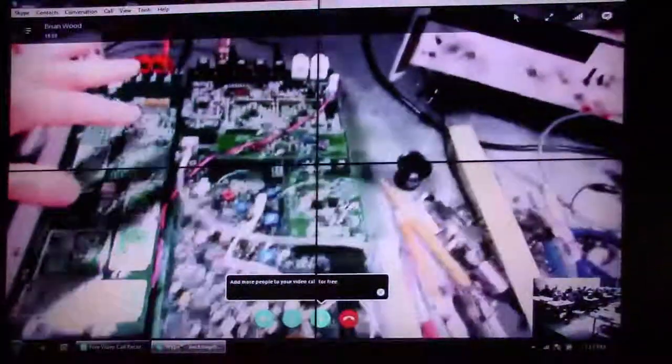It's a very complicated board — there's no way I would ever make anybody try to load that surface mount themselves. We've occasionally had people ask, and there's just no way. So all this stuff in here is the low power section of the rig. The other half is the high power section. That's the 10-watt power amplifier. What comes into there from the other half of the radio is low power, just about 100 milliwatts or so, and it gets amplified up to 10 watts.